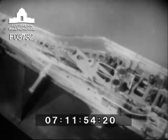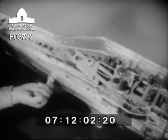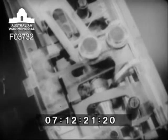The bolt is carried forward by the operating rod. The actuating cam roller now moves the feed cam to the right, which moves the belt feed pawls to the left. The feed pawls slide over the second round in the belt and then to the left of the round. The feed pawls will stay here until the bolt moves to the rear. This completes the first step: feeding.